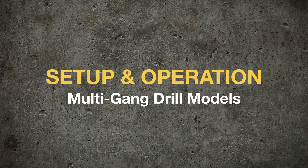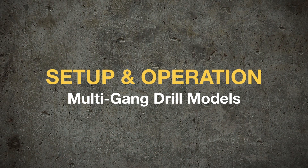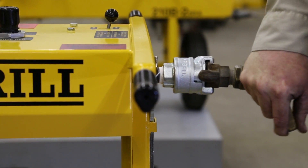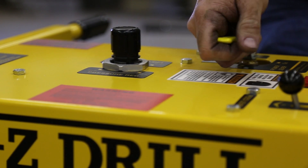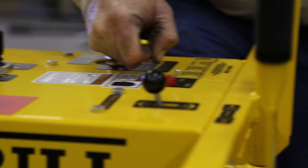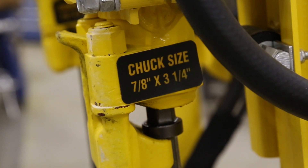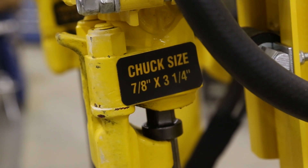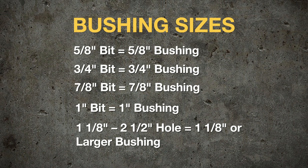This video will show you how to set up your Model 210-3, 4 and 5 SRA drills correctly every time. Before disassembling or disconnecting parts of the unit, shut off the air supply, disconnect the air hose, and remove pressure from the system by opening the power lever to the on position. Make sure the chuck size of the drill bits matches the chuck size of the drill listed on the side of the drill motor. Also be sure you have the correct bit guide bushing to match the bit you will be using.